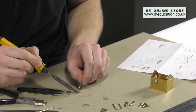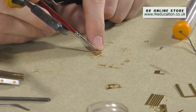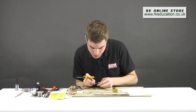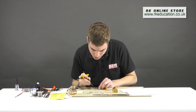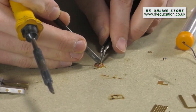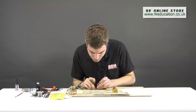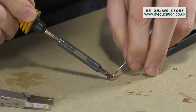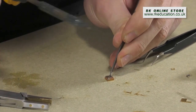For sweating, apply a very small amount of solder to the top of the chimney. Then apply a tiny bit of flux to the top, and place the chimney cap on using tweezers, working it square with the other components. A lot of soldering is just fiddling with parts to get them to sit properly before applying heat. Hold the piece in place with a needle file as you apply heat, transferring it through the iron down to the chimney to make sure it's all worked around.